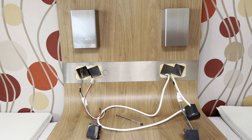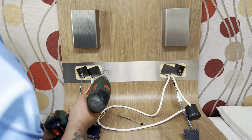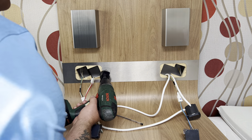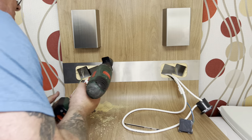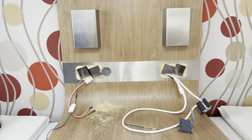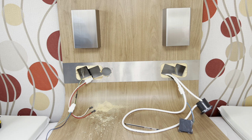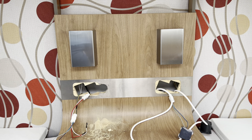What I'm going to do now is drill a small pilot hole to make a start. That's done - that's the start of it. Now I'm going to use the circular saw blade to cut the hole - the scary bit. And that's the hole cut out. That aluminium is really tough - all I need to do now is take a bit of this wood off here. I'll use the junior hacksaw for that. It looks a bit of a mess but when the cover and plug socket are on you won't see any of it.